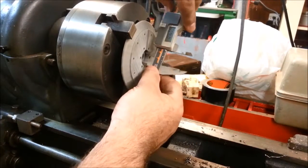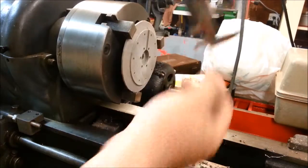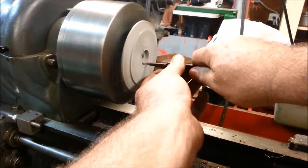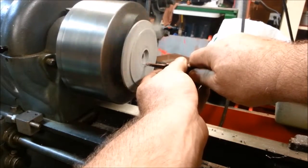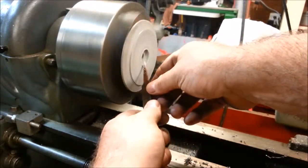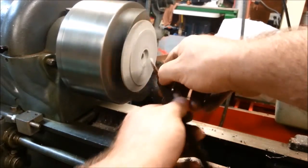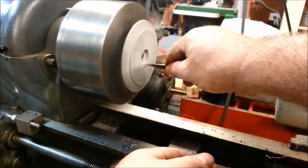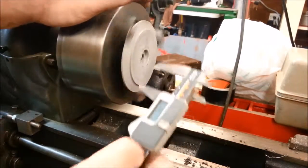We'll do the other side. This one is reading 967, got 970 there — we've got to get out to 994. Part of what I'm also doing is putting a square corner down on the bottom of the hole. A little bit of lead-in to get rid of any raised edge. These should probably be sanded slightly on this surface because this wasn't against the glass when it was printed. I'll leave that to Mr. Evil Twin.